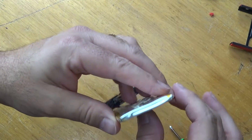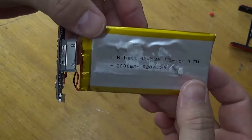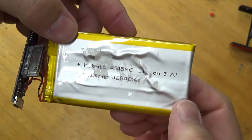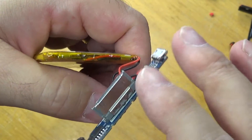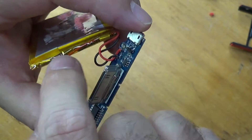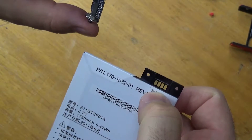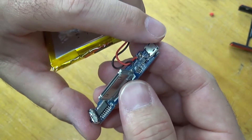So a lithium battery pack — lithium ion, 3.7 volt, 2,000 milliamp hours, 2 amp — and a couple of identifying numbers. This particular board obviously has the old iPhone 30-pin connector on there, just two wires going through. That's probably indicative that normally you can have more than two wires coming off a battery going into a circuit board. This battery I've taken out of an earlier project actually has four terminals for additional information, such as the temperature of the battery, the charge rate, and capacity. This one does not have that.